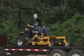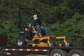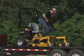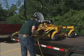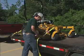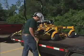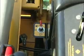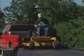When positioning the tractor on a trailer, make certain that the deck is lowered into its lowest position and that the machine is level. Tie it down by securing it with DOT-approved straps attached to tie-down rings or cleats on the trailer to ensure that it can't roll or move enough to loosen its restraints. Also, make certain that the fuel valve has been placed in the off position and the machine's park brakes are set as well.